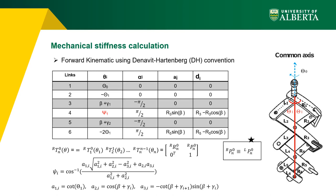There is a repetitive pattern for DH parameters between stages of the mechanism. The DH parameters for the first stage of the left branch are summarized in the table: gamma 1 and gamma 2 are the deflections of links L1 and L2, and Psi 1 is the passive parameter — the angle between L1 and L2. By using standard homogeneous transformations of both branches and requiring that the end-effector position must be equal in both branches at each stage, an analytical formula for passive parameters is extracted using the star equation.